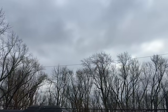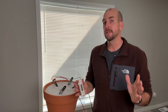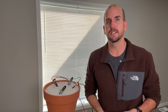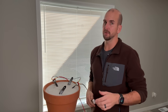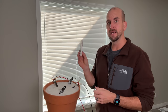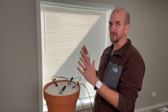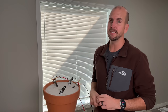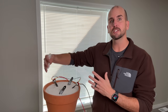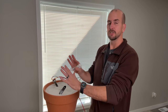Kicking off the day it's pretty cloudy but things should clear up a bit, so we'll get both cloudy and sunny conditions during this test. We've been up and running for over an hour now and it was pretty much cloudy that whole first hour, but good news is we are starting to get the sun peeking out and the power coming in is increasing dramatically. We'll take some temperature probes at the front and back within the sand battery itself and then I have another probe going a little bit deeper to show you there is actually quite a bit of difference in temperature. Even in overcast cloudy skies you can start to bring some heat inside, and hopefully we'll keep the sun going so we can really start heating this up and then measure whether we can distribute some of that heat throughout the room — can we put those aluminum straps in here and that fan on top and start to move some of that heat?